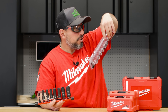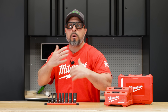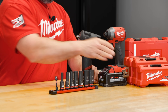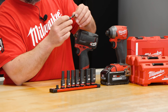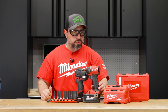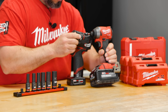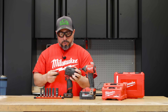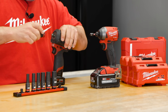The lifetime guarantee covers impact sockets only. If retailers aren't stocking single sockets, how would you go about warranting or replacing one? Now, this kit has two options to run these sockets because it does have that quarter-by-three-eighths adapter. You'll see you have your little ball detent — you can run these sockets in an impact driver. Pretty positive retention, feels good. Or you could go straight to an impact wrench — that really feels good.